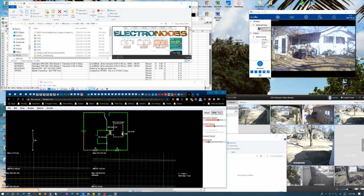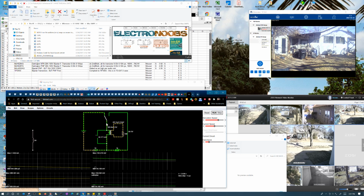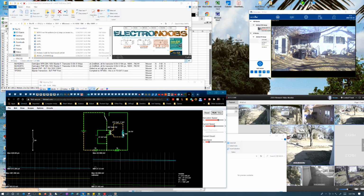and because it's seeing that 5 volts, of course, this resistor tries to load it as if it had 5 volts across it, and it does. It's able to, because it's small enough, I guess, compared to the amount of target current we have over here. This resistor is small enough to where it doesn't significantly conflict with this. Because remember, it's a 1-to-1 ratio transformer. But this will charge up.